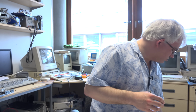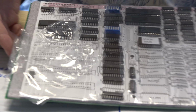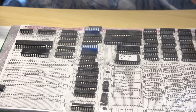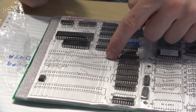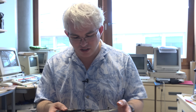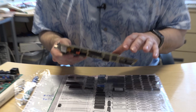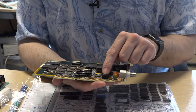So you put in the Ethernet cards, you want the SCSI cards, the RAM, etc. to build a system. But actually the same is true on the original IBM PC system. So if we look at the kit IBM PC I've got here, you had a series of five ISA, as they became known, extension cards where you could put in different cards to build up your system. These are the spaces here, and you would just literally slot in cards like this one here, which was a network card. This is actually a slightly later one, so it's got a 16-bit extension, but this was the original card thing here.